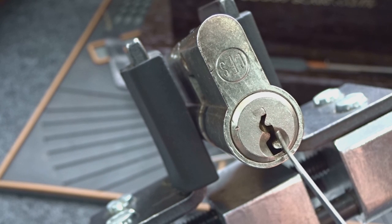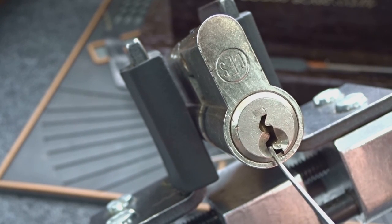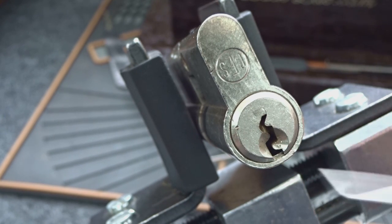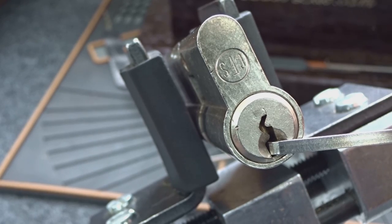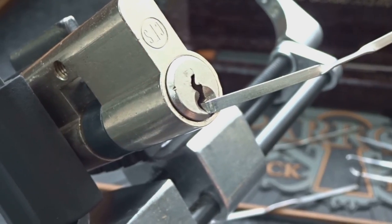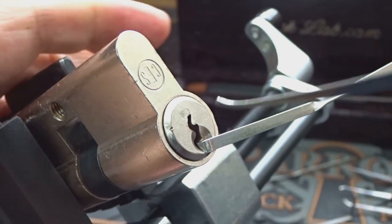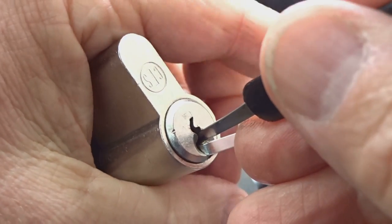I really have to get that oriented a little better. From this ledge I've got to go up like that — I really can't work from down here because that big piece of the keyway will just stop my pick. So I might as well use this space for a tensioner, and that way I have all of that upper area to work in. I'm going to take my medium tensioner, place it right there, and make sure it's not pinching on the body of the lock.